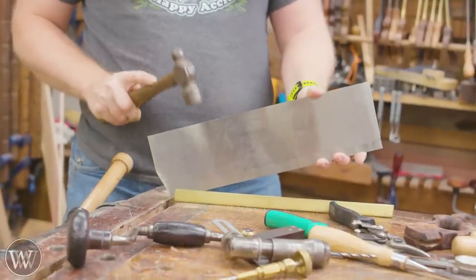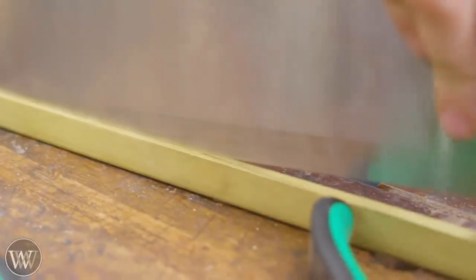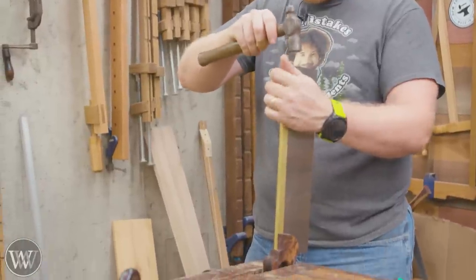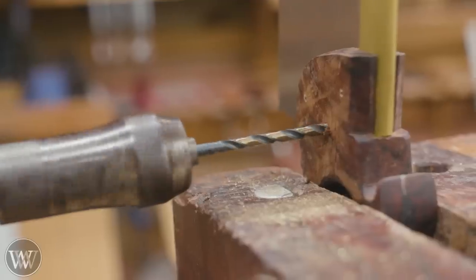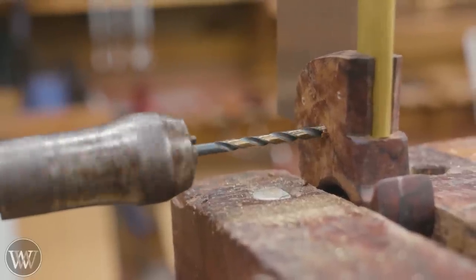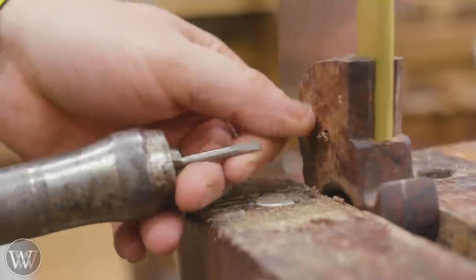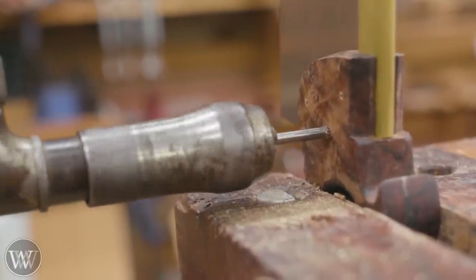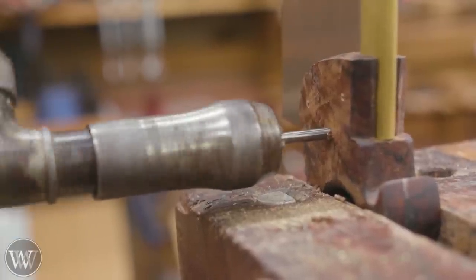Next, we need to make the slot for the back to fit in. He had a rounded end on this one and I wanted to make it flat and then round it the other direction, just to fit a slightly different style. I'm tapping the back end on the plate, and I probably should flip it around and use a soft hammer on the back rather than using a metal hammer on the plate - I just don't want to damage it. But I'm going to be cutting all the teeth in this and taking a little bit of material off, so it's okay right now. Next, we need to fit it into the handle, make sure everything's clamped in place, and then drill the holes. We're going to drill through the wood with a regular twist bit, and then come in with a metal bit that will allow me to cut through the brass and the spring steel much, much easier.